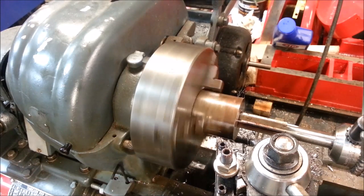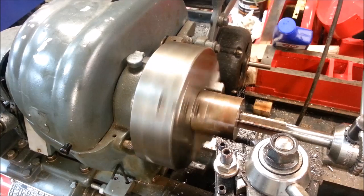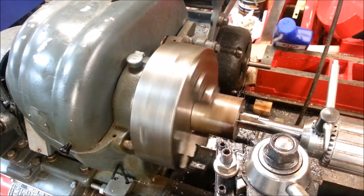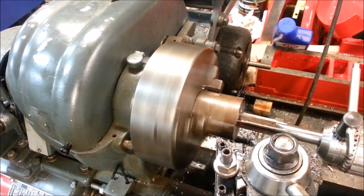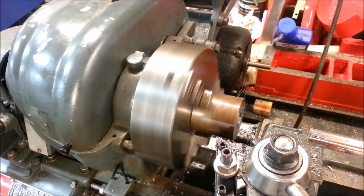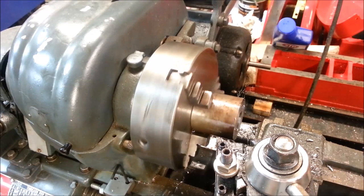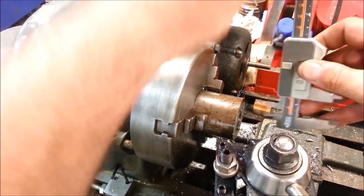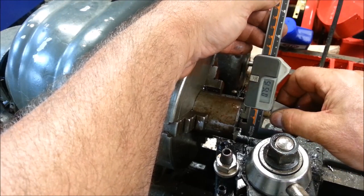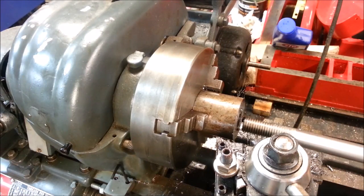In a perfect world, I'd like to take out not — you know, a 64th is about 16 thousandths — I'd really like to just take out four or five thou with the ream. There it is — one three-quarter inch hole, approximately two and a quarter inches deep. Let's take a half-ass measurement at it. Got 0.7515 there. Plenty close enough for a wheel. Let's try our shaft in it and see how she fits.